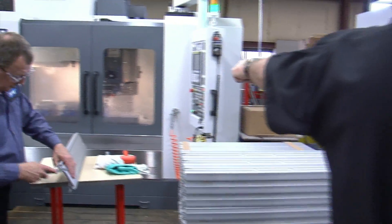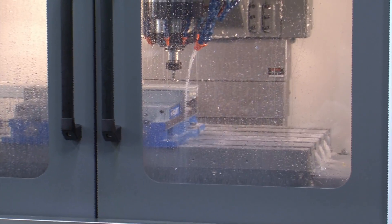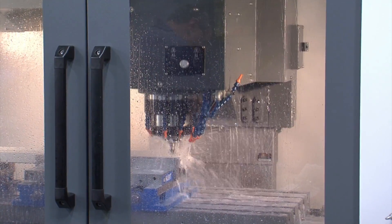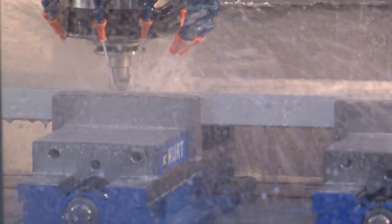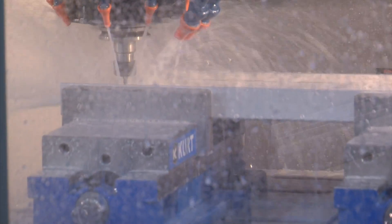You can see the speed of the milling head cutting material. That increased by 40% — the spindle went from 8,000 RPM on the machines that were here in December to now 10,000 RPM. That's your tool change, and that increased by 40%. So as my labor costs go up, the only thing I can do to compensate is automate and get as much of that time out as possible. I literally take man-hours out, so that covers material costs and labor costs that increase — up until a point, then you have to do a price increase.